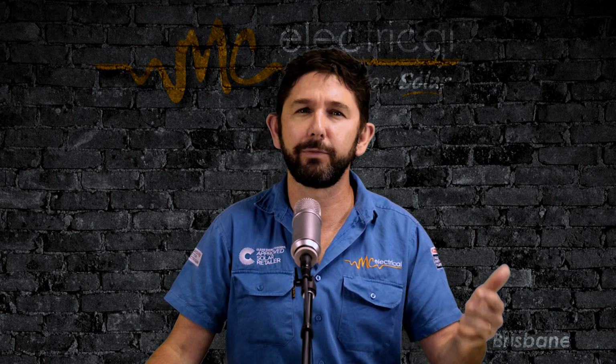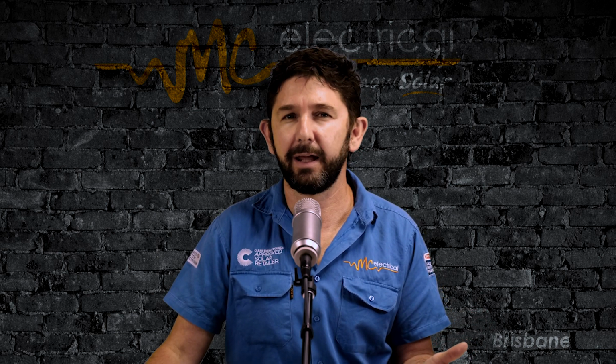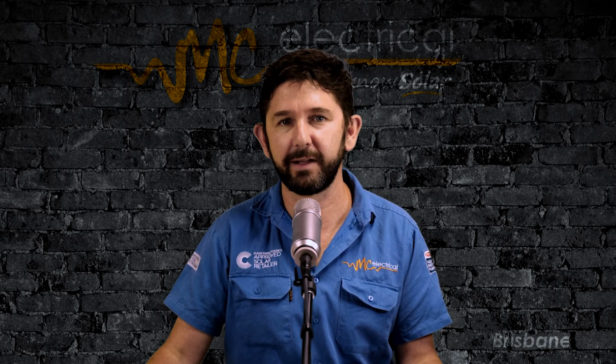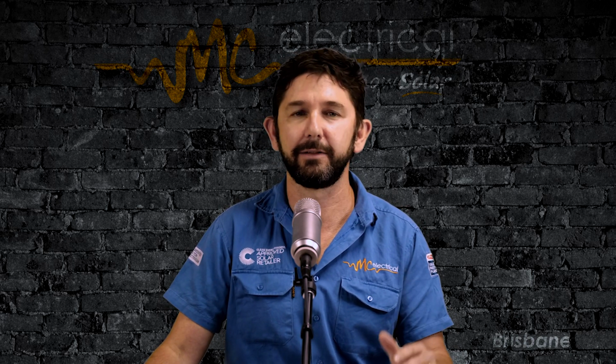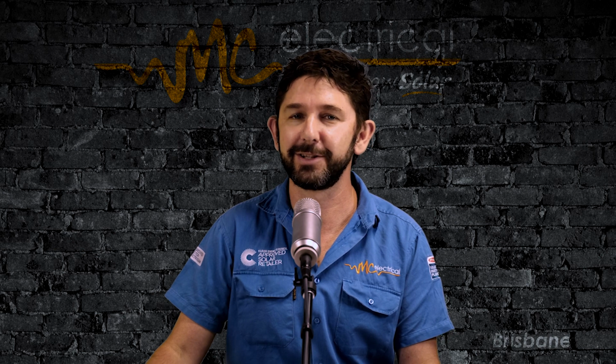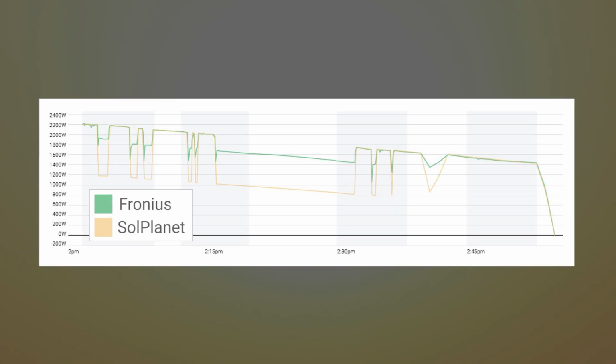And then I lightly shaded some of the panels by clamping core flute with holes in it, and I put posts on the edge of the panels, and both inverters seem to handle this light kind of shade around about the same. Now, I'm not about to keep these systems running for the next 12 months to see how they work in summer and how they work on different cloudy days and moving shade. So I crash tested them. First, I wanted to see how the inverters worked in extreme conditions. So 2 of us threw cardboard on 2 panels at the same time and then removed them after a period of time. This is one graph that shows the results.